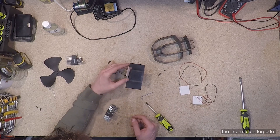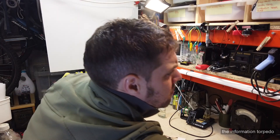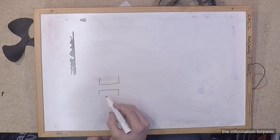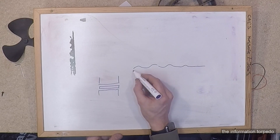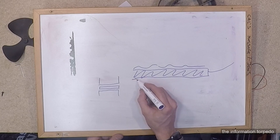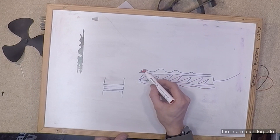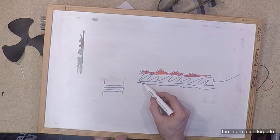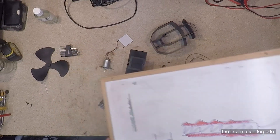I'm not surprised at all that this one isn't working well, because there's no heat transfer paste on either of these surfaces — they're bone dry. To explain why that matters: on a microscopic level, the surfaces of the two metal extrusions and the peltier sandwiched between them are not perfectly flat. Barely any of the surface is actually touching, so when you fill those gaps with heat transfer paste, it transfers heat between the two items effectively. Without it, there's a very good chance the peltier has been damaged.